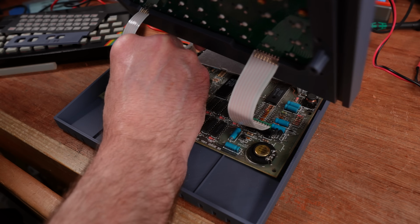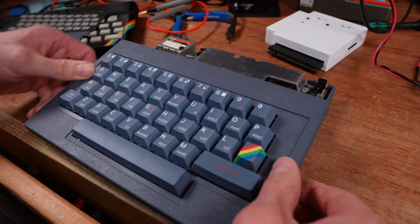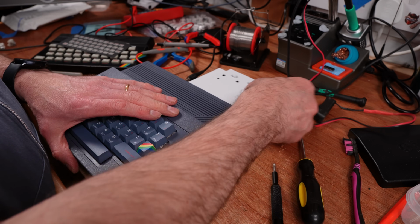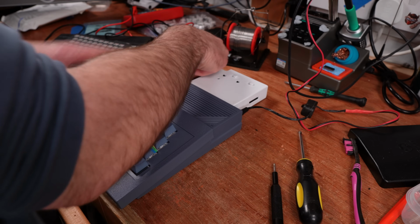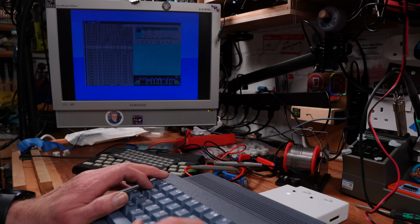It's worth noting that Lee Smith recommends you replace the voltage regulator with a Traco type switching regulator to stop heat building up inside the case, which could warp the plastic. I won't be running this for very long, so I'm happy to risk it for a few minutes testing, just to get this video done.